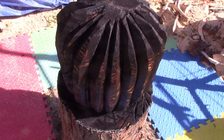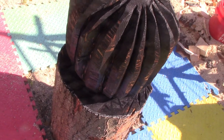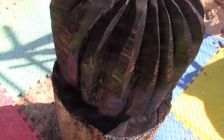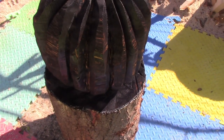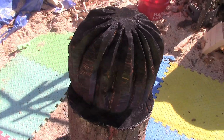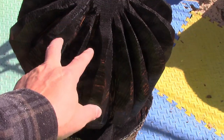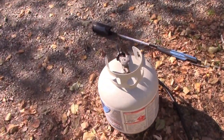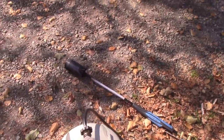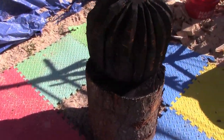What you missed off camera is I burned it — I had to use a large tiger torch. You can see how deep I burned it because it's hard to get the cracks to go black. The reason is twofold: one is for coloring and shading, and two, it protects the wood. As I sand this down, most of the water will sit in the cracks, so burning protects it from rotting. In case you don't know, a tiger torch is one of these things.